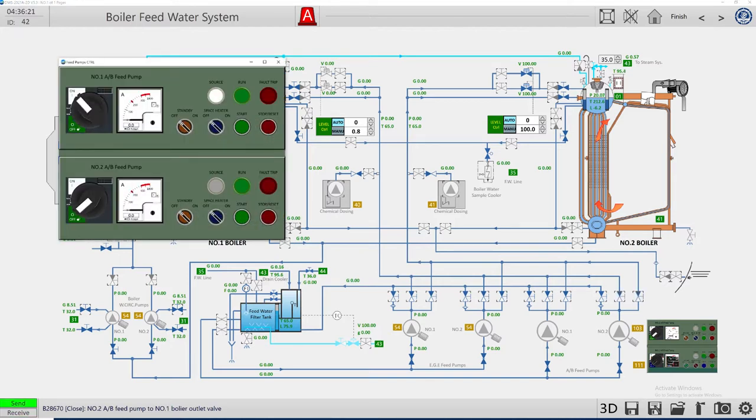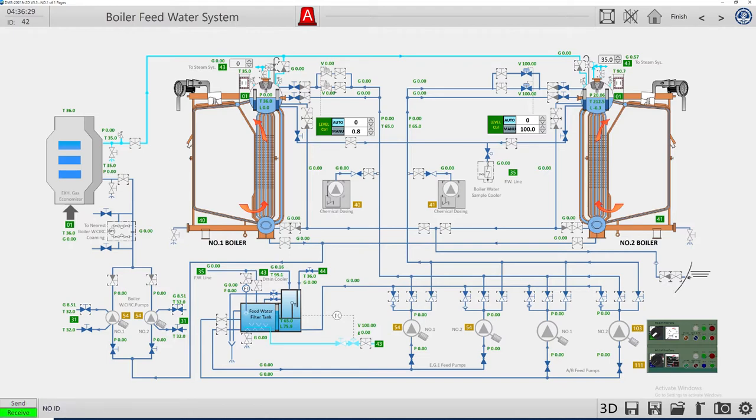Let's start the panels and preheat our motors — everything looks good. Let's open the water from the controllers; this is the emergency filling. We'll keep the level at 100. Here is the return line going to the water sample cooler, and we'll also adjust our chemicals from here.